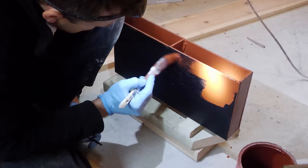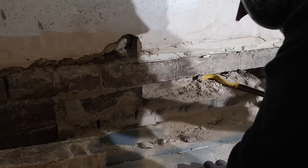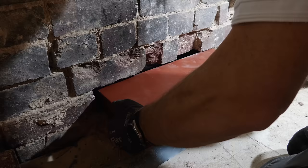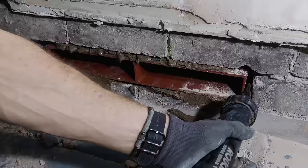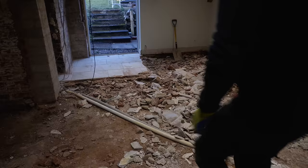It was simpler to get a strengthened steel box made to take the place of one course of bricks than having to excavate two courses to put concrete lintels in. I thought about drilling a series of holes through the very hard engineering-style bricks but wasn't sure how easy that would be. So with the new box ready, I carefully excavated the bricks through the double-course wall, inserted the box and mortared it into position using my new mortar gun. Obviously make sure you get a structural engineer's sign-off before doing any alterations to your walls.